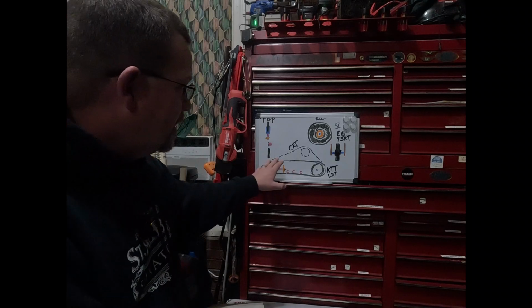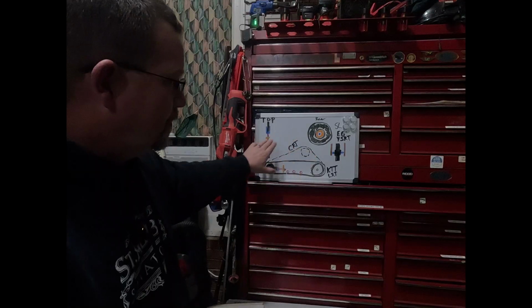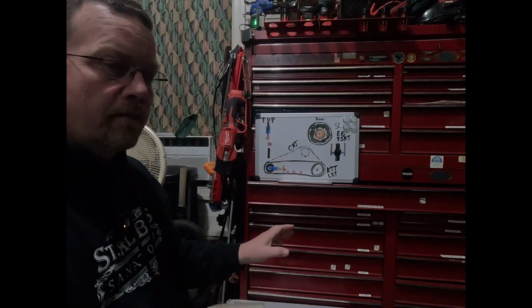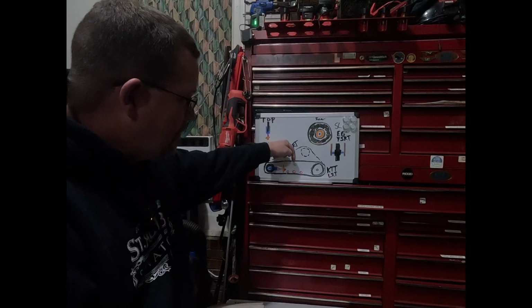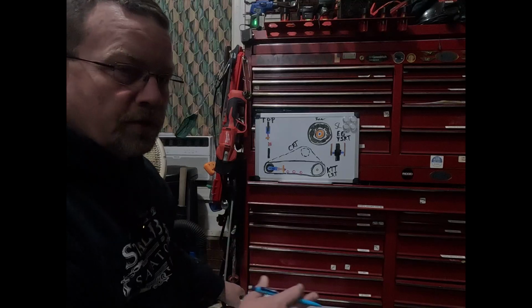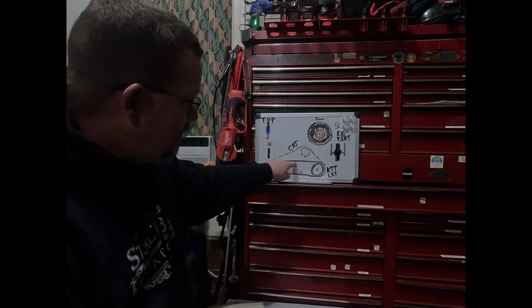Now that you got it all set up, everything's there, run this, even though you haven't put any tension up here, run it a little bit just to make sure that you can look down and make sure that your track is somewhat uniform. Now go ahead, start putting the tension on. When you do the tension, just make sure that when it starts squeezing up like this, don't go really tight. You want to be able to push down at least an inch. So let's say this flat spot right here, you want to come at least an inch down here, almost touching the frame here.